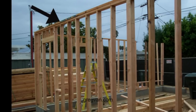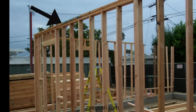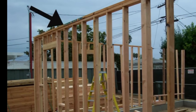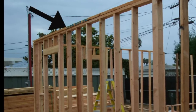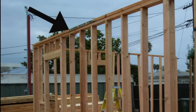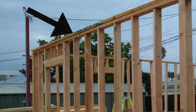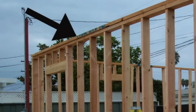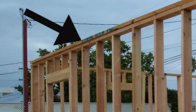This top plate has not been nailed off completely yet. You will need to make sure the plates line up — don't nail them off-center. Line them up as best as you possibly can and try to use the straightest materials for your top plates. Your bottom plates usually get bolted or nailed down, so you can do a lot of adjustment there. But you won't have that same option with the top plate, so use the straightest possible materials you can.